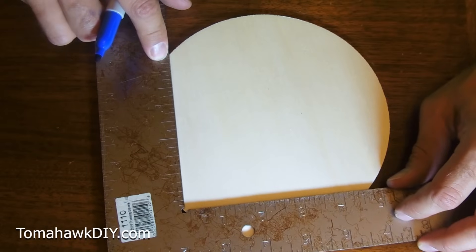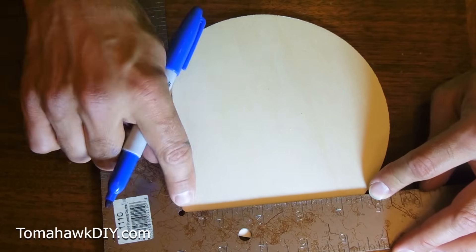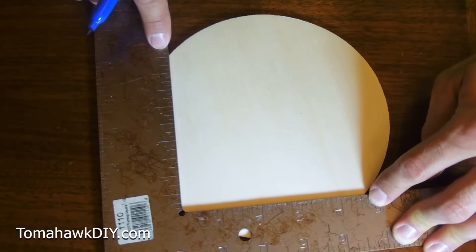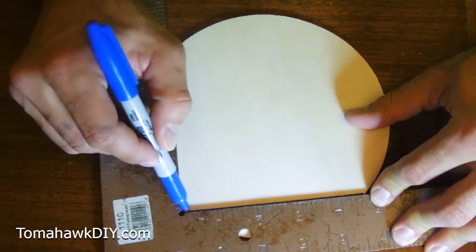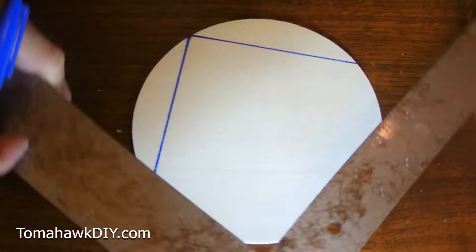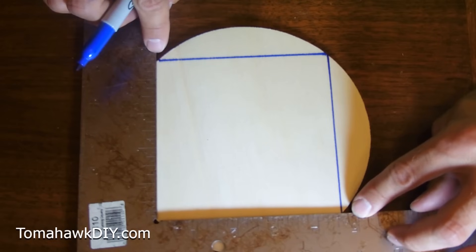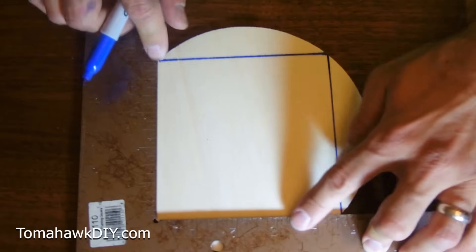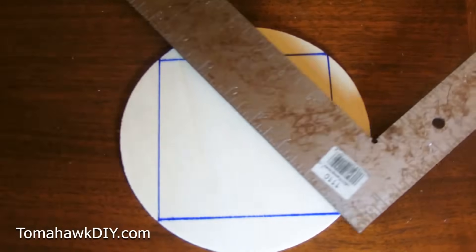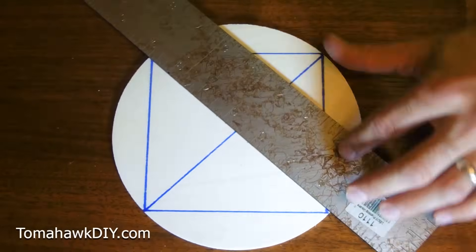So let's see — 4 and 1/2, not quite, we're getting close though. It can be a little bit tricky to get it. There's 4 and 5/8 on that side — 4 and 5/8 on this side. So I'm going to draw my square here. Now if this has been done right, when we spin it around here we should be able to line these two points up again with 4 and 5/8 — like so, boom. And we should be able to finish that square. So with our square drawn, draw our diagonals and that's going to hit the center.